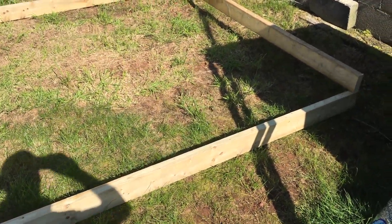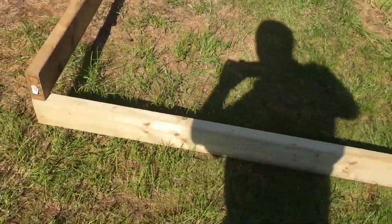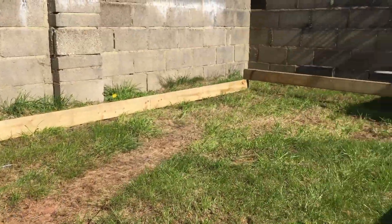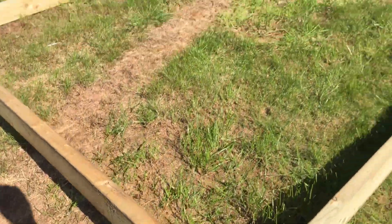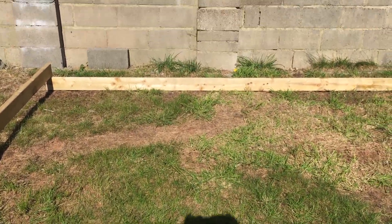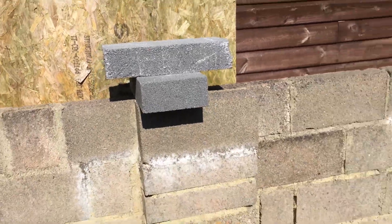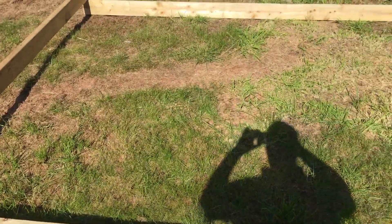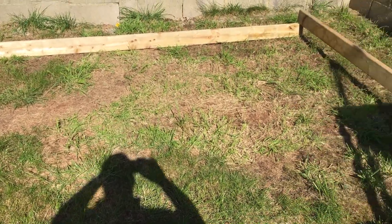Once I've made the frame, I'm going to start pegging out where the concrete blocks are going to go. There's loads of air there, all the rest of them seem to be on the ground, so I reckon I'm probably going to have to raise this wood up a little bit on this side. I've got some concrete just in case, I've got some gravel, and I've bought some new blocks — six of them, which came out to about seven quid from Jewsons. I'm going to have one on each corner and then two in the middle, just to brace the two planks that go across.